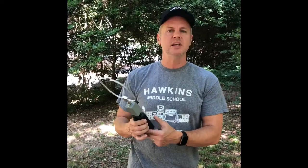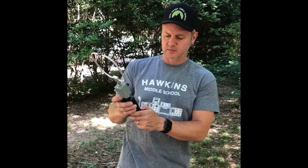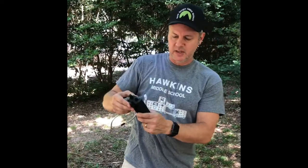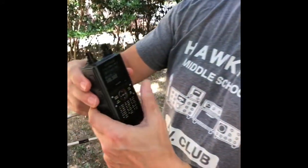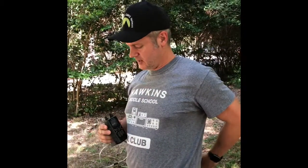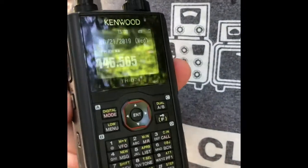See you Saturday. Another technique to dampen the signal of the fox — or attenuate it when you're close in — is simply to take the antenna off your radio and/or use body blocking. In this case I'm going to take the antenna off, and you can see I still have quite a bit of signal strength. But if I body block it, the signal strength goes down. The fox is behind me and I'm blocking the signal with my body. That's another inexpensive way to attenuate the signal of the fox.